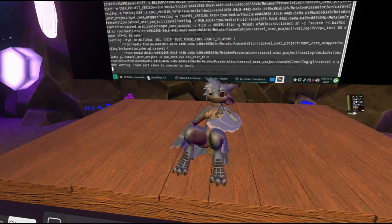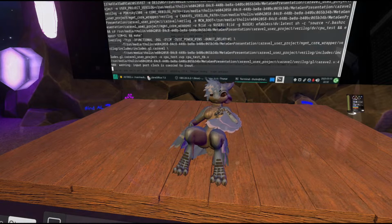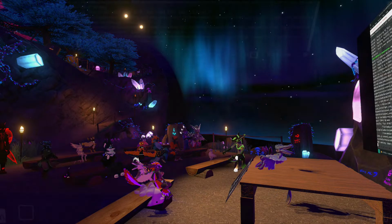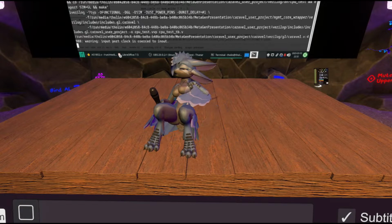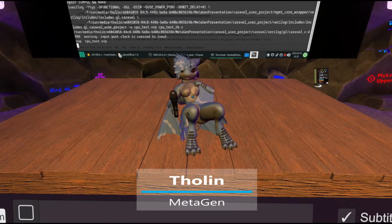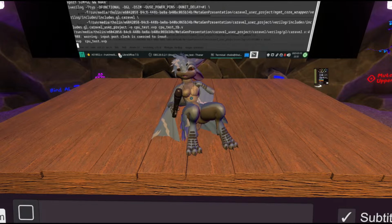My question was, can the simulation also simulate analog circuits, or does it only work for digital circuits? As I said earlier, the process development kit includes models of the production process of the different transistors they can make, just so you can run simulations. I'm not sure if you were there yet, but I showed a screenshot of a tool called XSchem, which can be used to develop analog circuits, and it can, in its simulations, even account for things like the physical temperature of the chip and voltage fluctuations. So, yes, you can run incredibly accurate simulations.